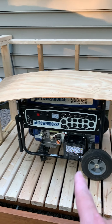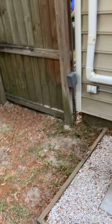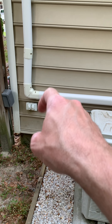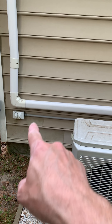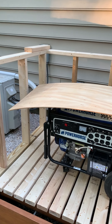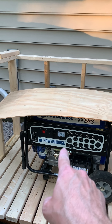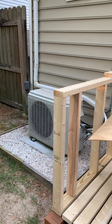As far as the gas goes, my main is on the other side just around on the outside here. I actually have a gas line inside this room here. I'm thinking about coming out here and elbowing out — I'm not going to hard pipe over here. I spent about $250 on a really nice natural gas flex line two years ago, so I'm going to use that. I'll have it coiled up inside here, hard connected, and when I need to run it I'll just have a little cap that I can poke out and run it to a quick disconnect.